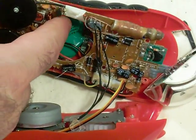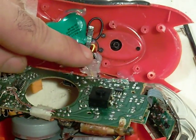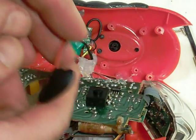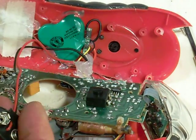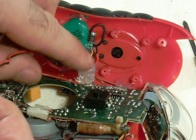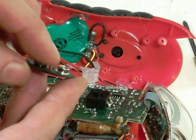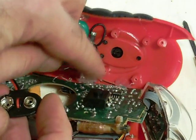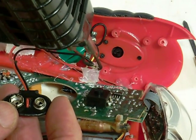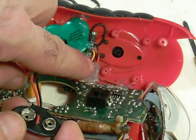What I did was lift this circuit board off and trace the wires from this battery up to the circuit board. Then I basically just intercepted the wires — I soldered the 9-volt clip right to the battery wires going up to the circuit board. I've since used some hot glue to make everything hold together so nothing shorts out. I basically used a solder gun, heated up the insulation to melt it off, put a dab of solder on, and intercepted the wires from the battery to the circuit board right there.